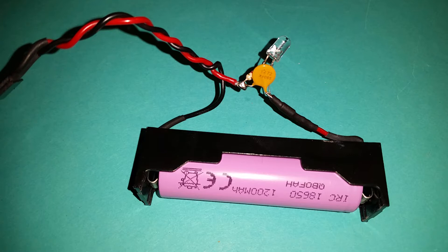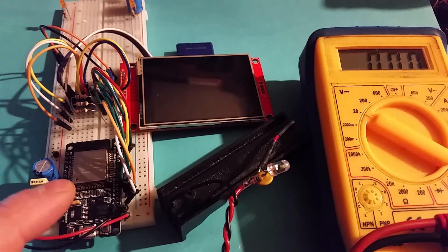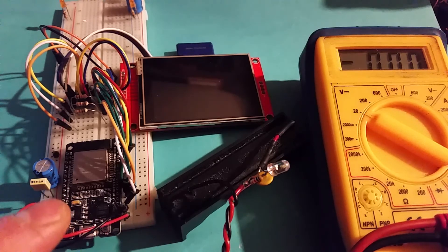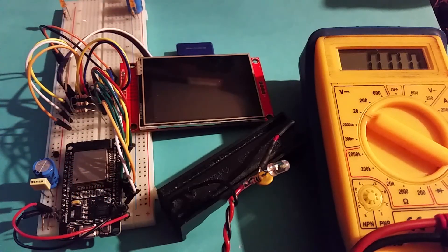Because there's no voltage regulator in the circuit, it's possible to go over-voltage on some components. The ESP32's maximum voltage before damage is 3.6 volts, and as the battery can be 4.2 volts when fully charged it would definitely damage the ESP32. You also have to be careful of other components you want to power, like the SD card, the LCD display, and the touch sensor.